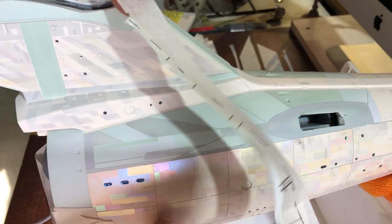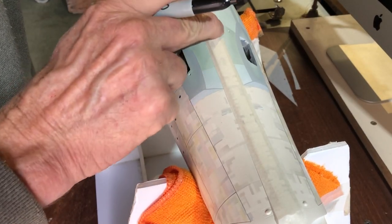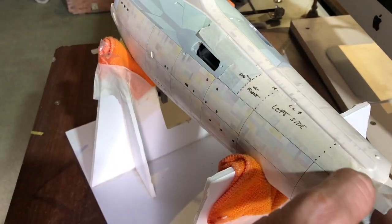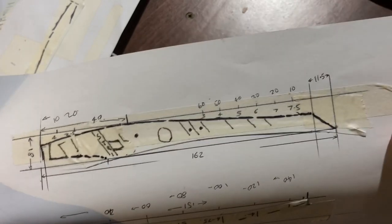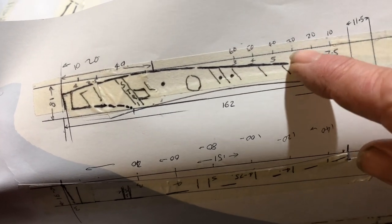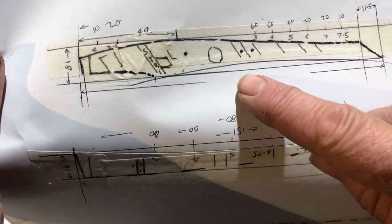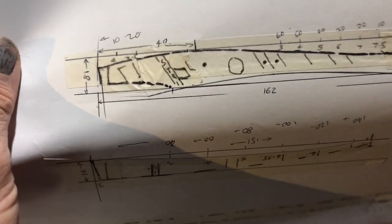So that's for the top section — that will be transferred into CAD. Going to do the same thing with the spine: super rough, fold it over the edge. To get the outline from the piece you end up with a couple of datums you need to put on there — find a nice datum to work from, give yourself the distances to the line from the datum. Then you can form this shape into CAD, cut it and test it a couple of times until it's absolutely right, then make the five colour templates.